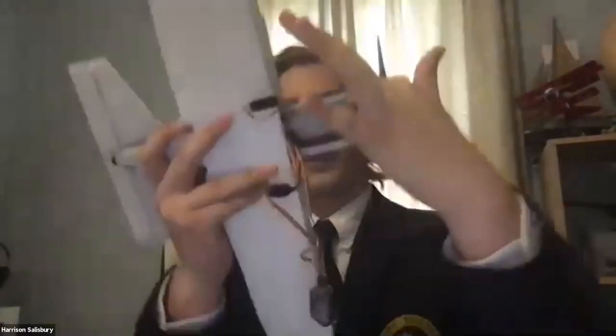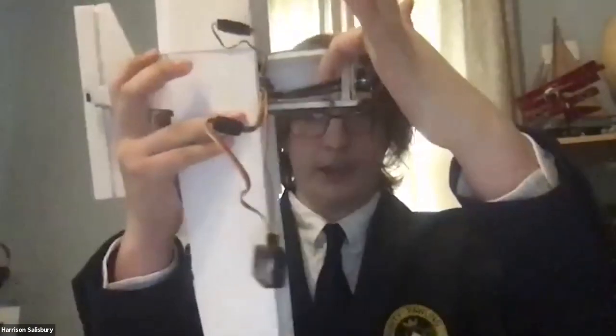One had an R on it, and since it had 2 motors, I didn't know if that meant right or reverse. So I did a lot of experimentation to figure out which propeller was actually supposed to go on what, because I didn't notice that the 3 unmarked wires that connect the motor, if you change the order in which those are connected, that changes the direction. I was very confused many times when the propeller I thought I had tested was for some reason pushing the plane backwards.